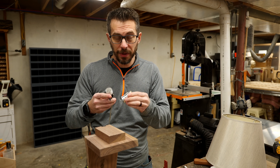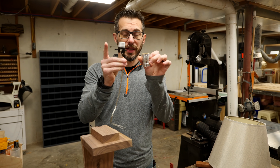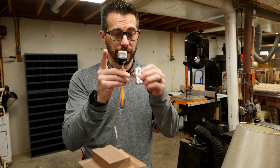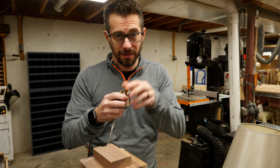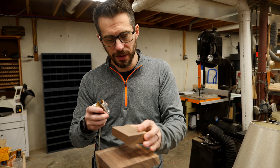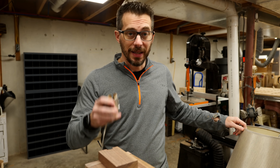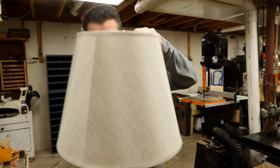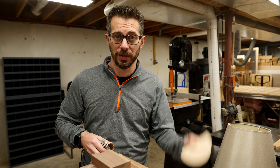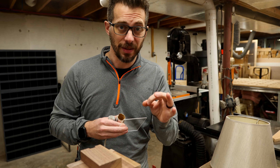This thing is just about ready to put together, but we finally have to put the lamp on this lamp. I'm going to use a small lamp kit — these are really inexpensive and easy to put together. You just wire up the wires to the terminals and stick it onto the lamp you want to make. We're going to be putting on another piece of walnut that will go right here on the top, allowing the wires to drop down into the channel on the backside. Then this piece will hold the shade and it will actually look like a lamp. We still need to dye the leather, frost the acrylic, and put some finish on — and then this thing will be done.